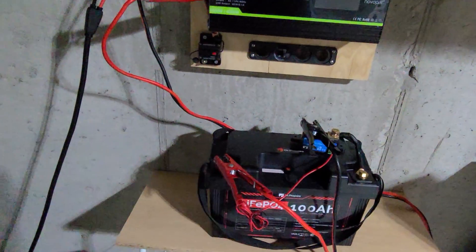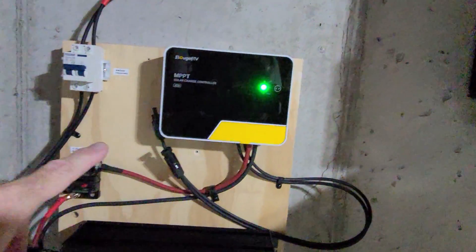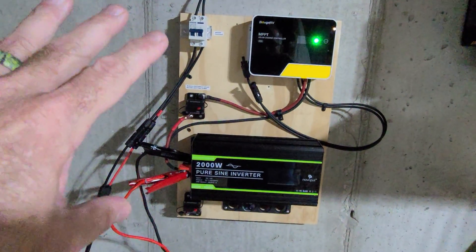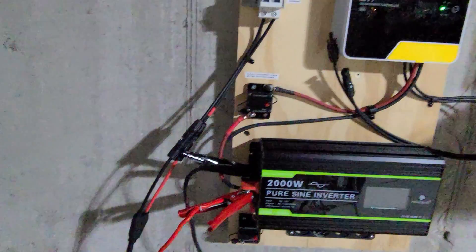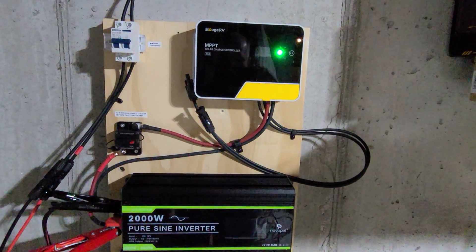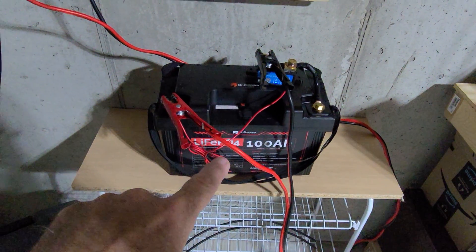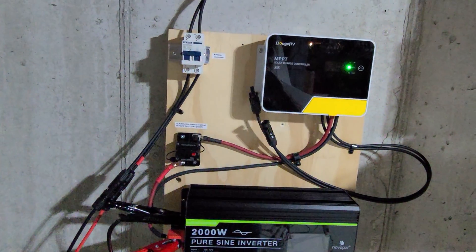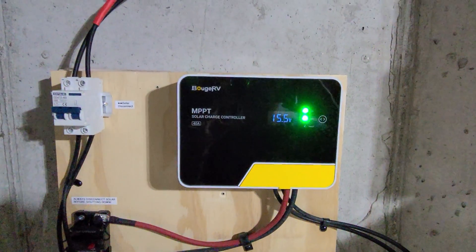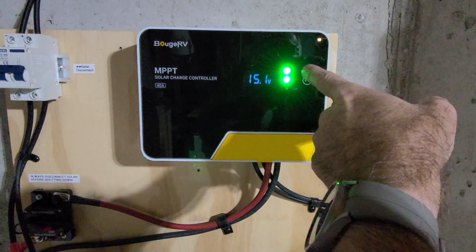It has been one hour since I hooked this little contraption up, and you can see I've got a green light on my charge controller — so this thing is turned back on. It's actually safe to go ahead and put some solar in there. I've hooked solar up to a different unit for another test I'm running, but I'm going to disconnect that and see if we can start actually charging this unit. Let's see if we can start charging — we should be able to, since the charge controller has been energized. Let me switch the cables over.